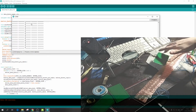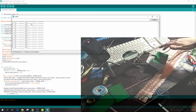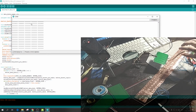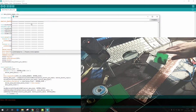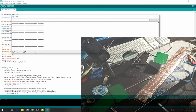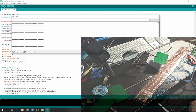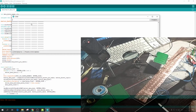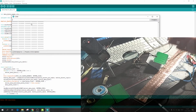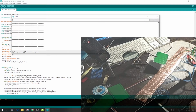It works very slow, and it cannot be used. Cannot be used at all. And I think that is because of the ground hatching I used here. It takes away part of the capacitance that is sent to the pads, and that is why the speed of registrations drops sharply.